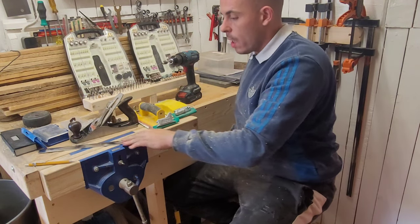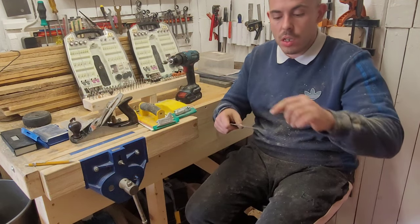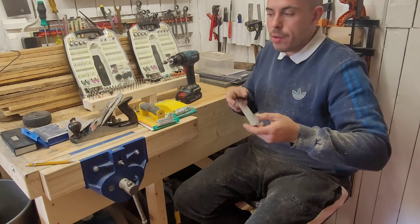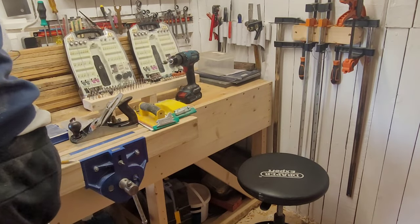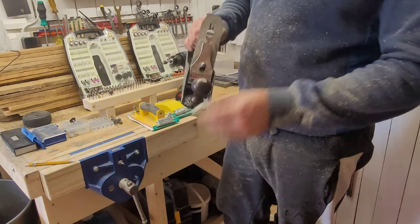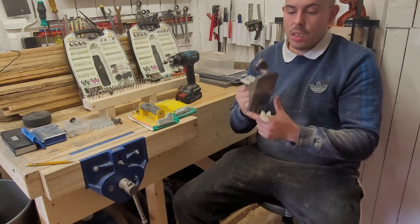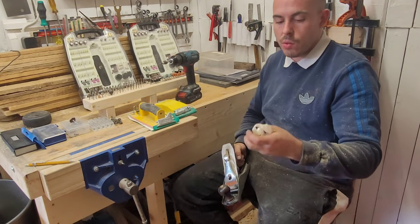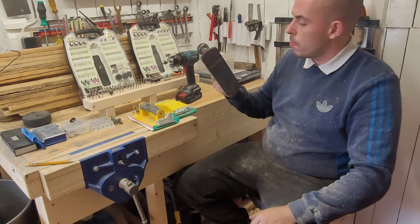And then obviously that square isn't long enough, so then I whipped out the ruler, and that's where a couple of extra dots along, so you know you're going straight, half inch in all the way down, comes in handy. So ruler, and then bit of planing. It's always easier to plane, as long as your plane's nice and sharp, you don't have to do much sanding. And I always do a bit of sanding after anyway, do the edges and that. So curly whirlies, bit of planing.